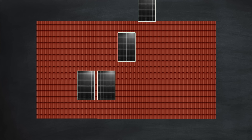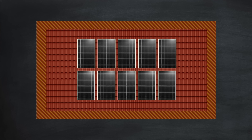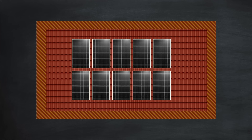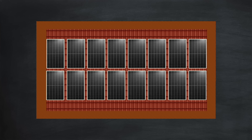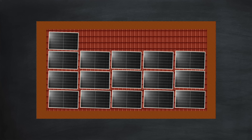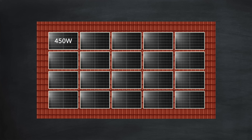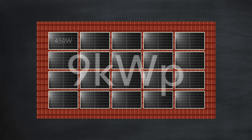When you're thinking about getting solar panels on your roof, one of the first questions is how many? Aesthetics will certainly play a part. On this roof we can easily fit 10 panels, but there is space to add more — we just need to respect any roof margin regulations that your country may have in place. With a slight adjustment we can fit another 6 panels. And if we place all the panels in landscape instead of portrait, we can get another 4 panels onto this roof. Now if these panels were 450 watts each, that would make a total array size of 9 kilowatts peak.